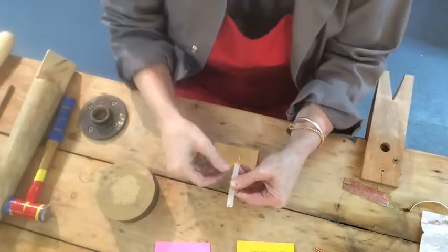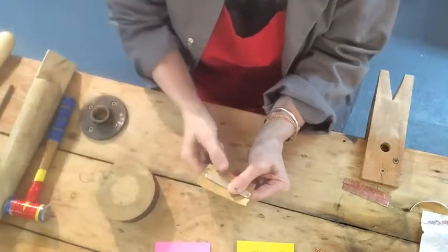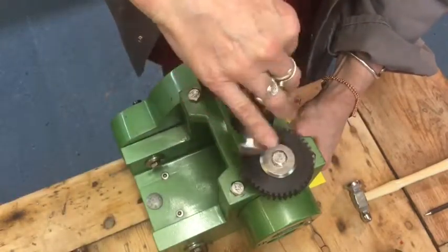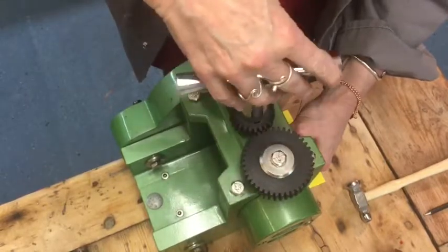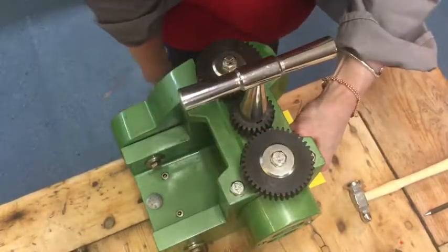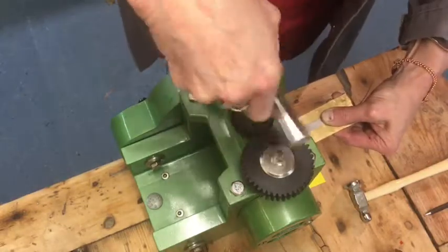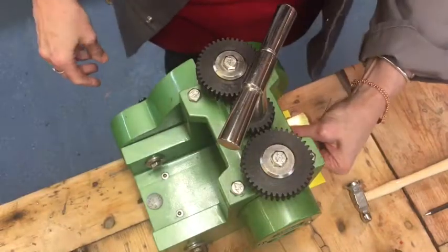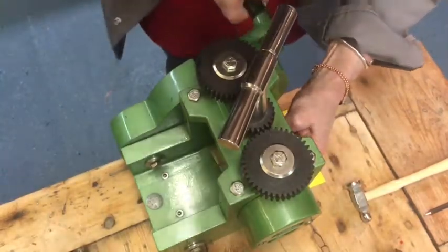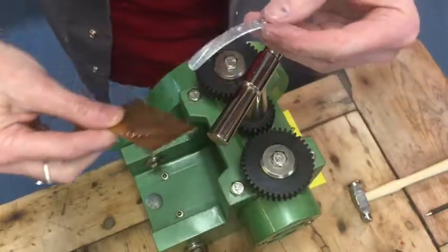Okay. Now I'm going to lay this on my brass sandwich. All right, I'm going to loosen my mill until I can fit the whole sandwich in. Then I'm going to tighten it down until it's grabbing. Okay, I can't pull it out. When it's about that tight, I'm going to back up. Now I'm going to give it a good tightening, like that far. Now I'm going to feed the whole thing through. That was probably tighter than I hoped.